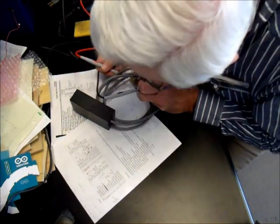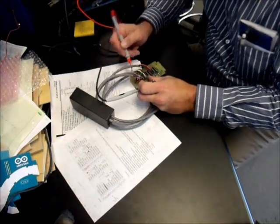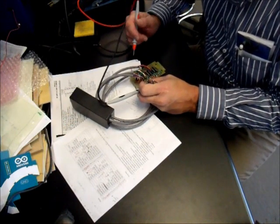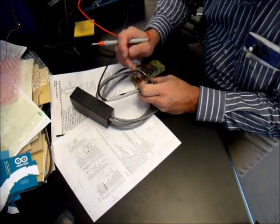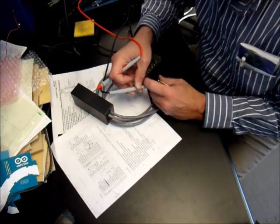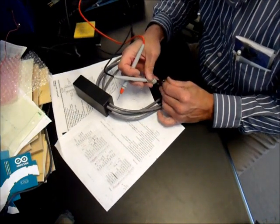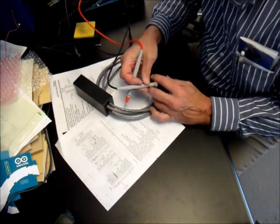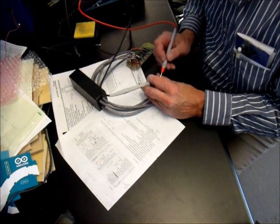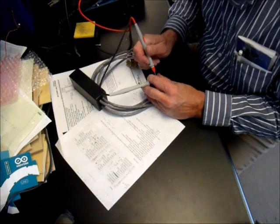The center of the voltage regulator — that pin is looking good there. I'm just going to check out the other ones. The plus 12 volts should be essentially the next pins over — that one and that one, but not any of these others.